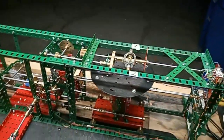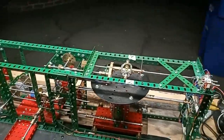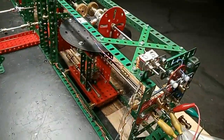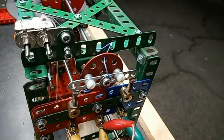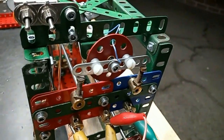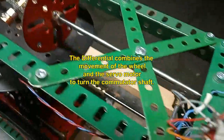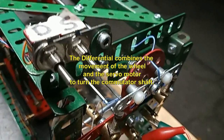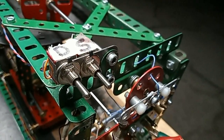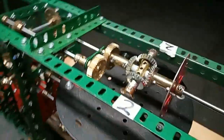Instead of using a torque amplifier like most differential analyzers have, Ron has a servo system which is very clever, and it works. He used a Meccano commutator for the contacts. I didn't have any of those, so instead I just made something up out of pieces. The idea is that as the integrator wheel moves, it turns the commutator to operate the servo motor. As soon as that happens, the servo motor disconnects that connection by pushing the shaft the other way, and so you get an intermittent series of pulses that represent the movement of this wheel.